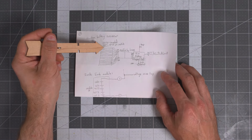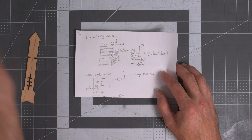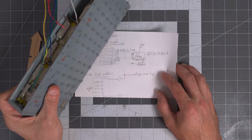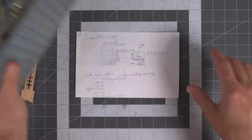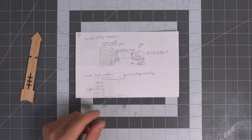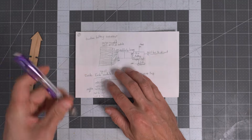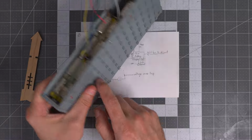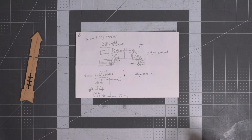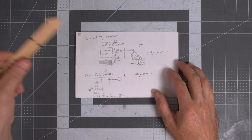So let's look more inside of each module here. There are 14 of the NexCell modules in the Gen 3 Prius. Here's one of them. You can see it has 5 cells inside. They are series connected, and that I've drawn here. So this is each NexCell module. The OEM modules, there's 2 of them. There's 2 OEM nickel metal hydride modules for every NexCell module, and I don't actually remember the number of cells in the OEM.